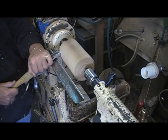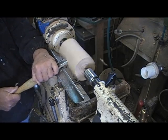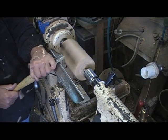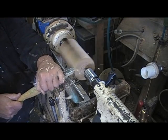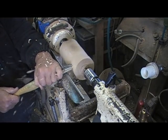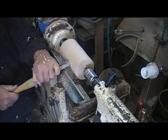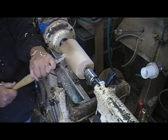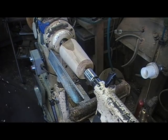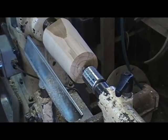I'm rubbing the bevel right now, because I'd rather slice wood than tear it away. I'm going to stop it so you can see — look how good those cuts are, and that's a roughing gouge, because I was slicing wood. I'm safe on my curve.